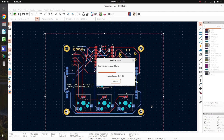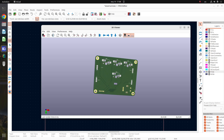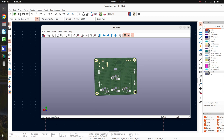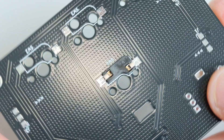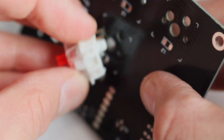Another interesting detail is that KiCad version 6 now allows me to set a hatch fill for the zones. For this PCB I have a front and a bottom zone, both connected to ground. Let's have a quick look at the 3D viewer in KiCad. When I was satisfied with the prototype, I exported the Gerber files, uploaded them to PCBWay.com and they were delivered. Here is the actual prototype board — on the front and on the bottom you can see the small net which is the result of the hatched fill of the zones.